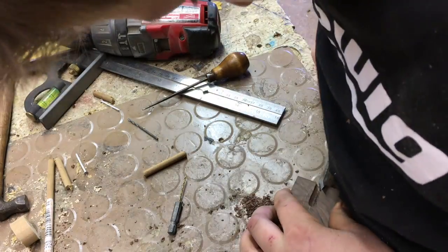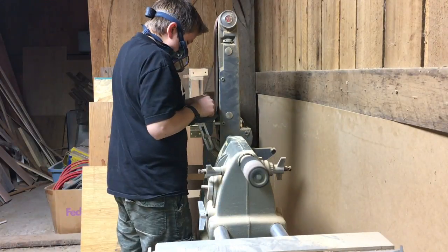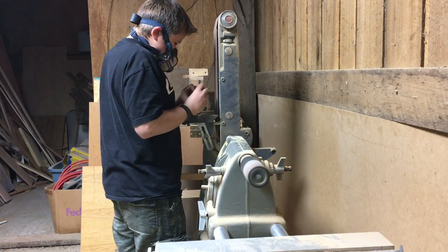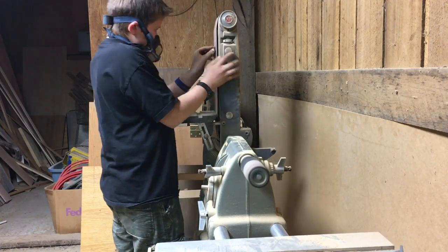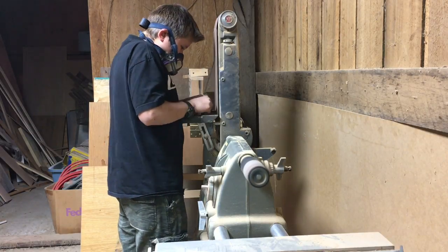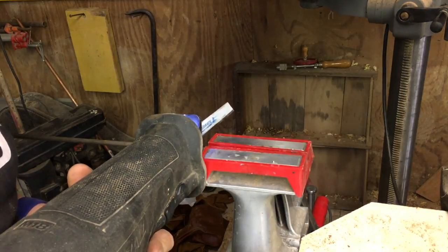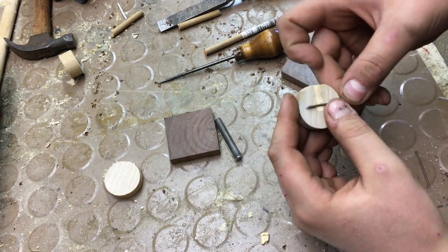By the way, this drill bit was a quarter inch drill bit. Once that was done, I just had to do a little bit of sanding because they had a couple of burrs and were a little rough. Now they're nice and smooth. The next thing was to cut a quarter inch piece of steel round — about a two inch piece of it.